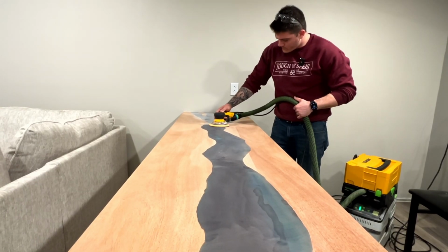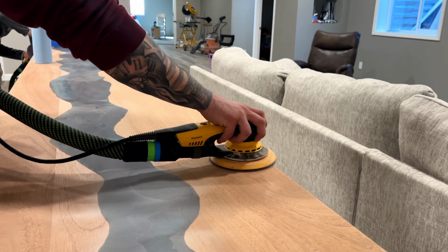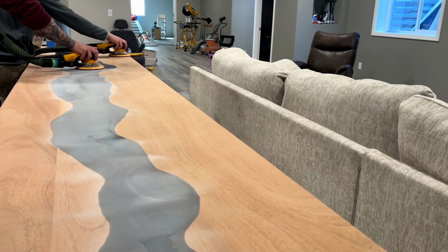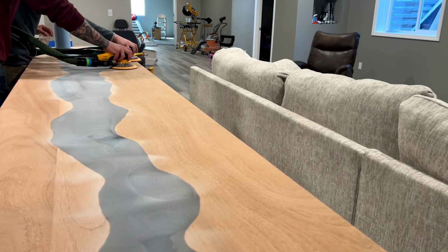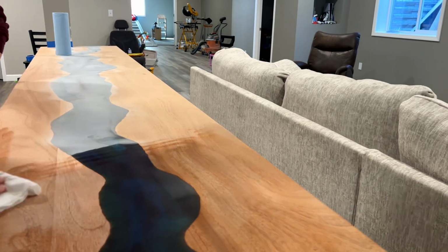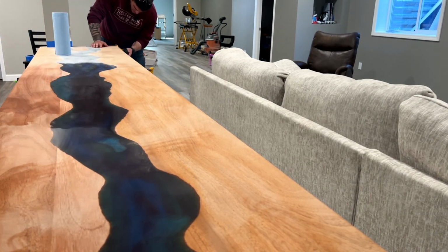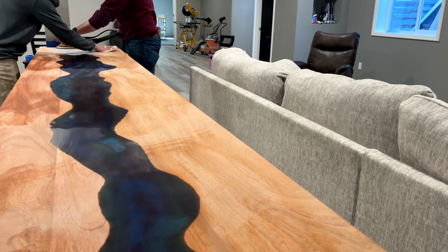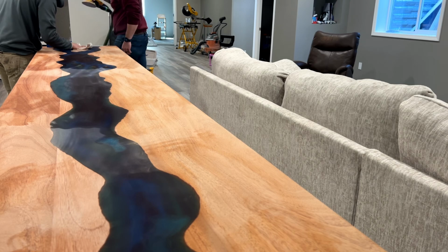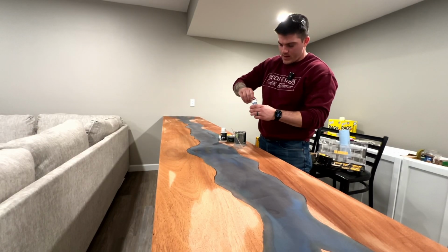Now, we're going to do a Rubio Monocoat finish, so these swirl marks might not show up that distinctly on the wood. However, we are doing a polished finish on the epoxy, at which point those swirls would be highlighted. Sanding was as typical as it gets, working from 120 up to 220, wiping with mineral spirits after each grit. And yes, popping the grain does work on epoxy too. The mineral spirits doesn't affect the resin in the same manner as it does wood, but it will reveal any tiny scratch or imperfections that need a little more attention. This ensures you're sanding both the river and the wood to perfection, allowing you to achieve the glass look in the river along with that semi-gloss finish on the wood portions.